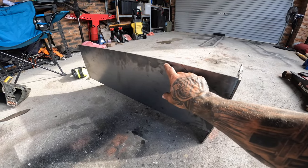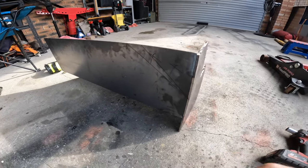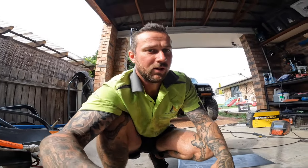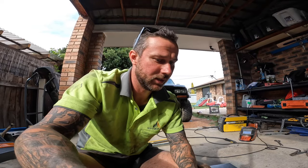Pretty sure that's where my number plate is going to end, and I'm thinking of going from the number plate down and across. I've got two bolt holes in that one and I'm going to put a third one in, same on the other side, so I've got three — the more bolts, the stronger structurally. I'll get new properly graded bolts rather than the old ones used a million times. I'll cut it to width, weld my side plate on the other one, bolt it on and plan from there.